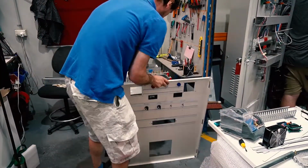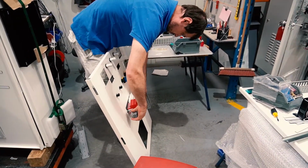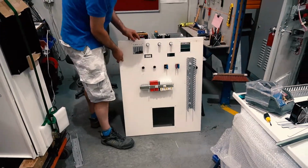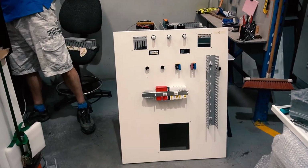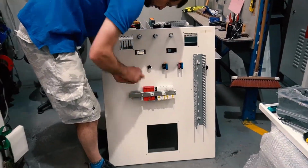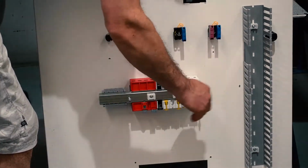We get our cabinet in, we put the gear tray in, and then we put the outer door on, so that gets assembled. And then we start running all our cables to the door, and then we put our floor in. So we've got 2 transformers and a choke that goes in, and we start wiring that up. It would take us 3 days, roughly 2.5 days.